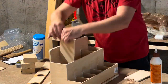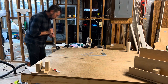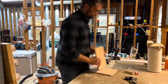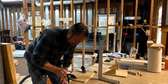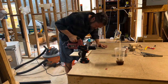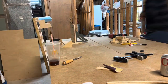Once the shelves were clamped and glued I moved on to the hand tool holder, meant for screwdrivers and wrenches. I started by using the Japanese pull saw to cut the base where the tools are going to sit, then measured out where the tools would actually sit and used my hand drill to drill the holes. In hindsight I would have made the screwdriver holes a little more accessible — phillips head works really well but flatheads not so much. I used my jigsaw to cut out the holes for the wrenches — I probably could have used a router for cleaner lines, but they served their purpose. Then I took it to the belt sander for rounded corners and edges, mounted it to the backing board using the speed square to ensure a 90 degree angle.